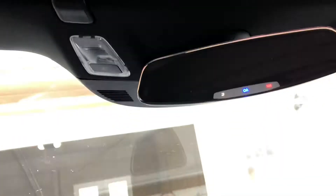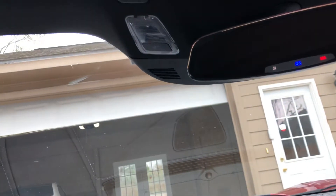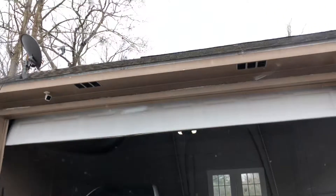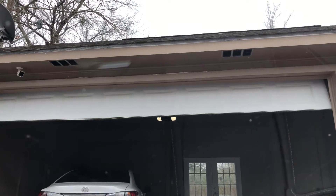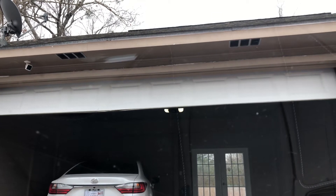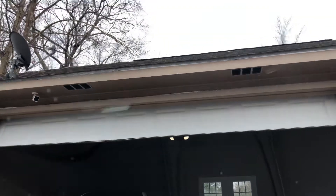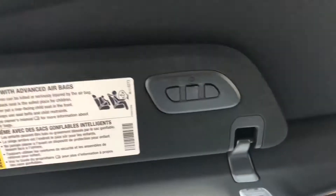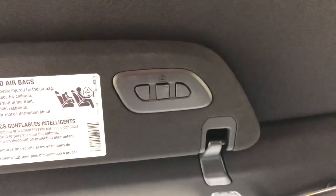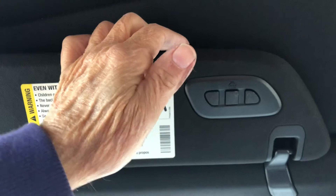It's going to go from a slow blink to a fast blink. Now if you don't have a rolling code, you're done. But most of them will have rolling code, so while that's blinking you've got to run up there — have a ladder ready — find the button on your garage door opener that sends out the pairing code, and press that while this is blinking.